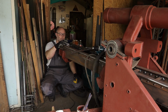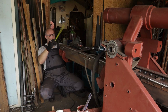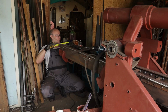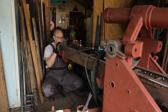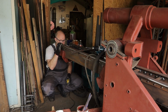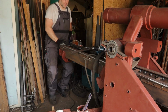So when I tapped it down, I could see it move a little bit, but I deliberately made it a bit more tight, so I have a little bit extra wiggle room, and that was 1 millimeter, and now it's exactly to size, so it's moved only 1 millimeter, so that's good. It's still within acceptable range. Well, actually it's perfect. So now I can drill the rest of the holes, and then it's on to the next part.